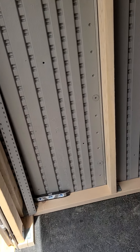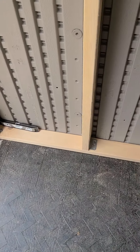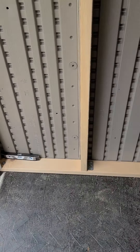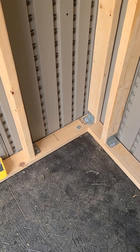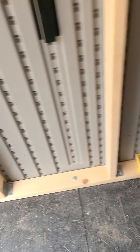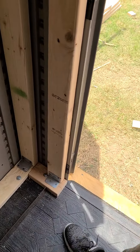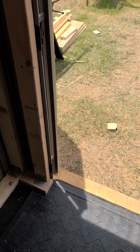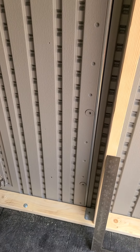What I did was take the lag bolts I initially used to install the actual flooring, removed them so there was no gap between my two-by-fours and the flooring, and put them down really securely in three different places on the floor studs. I put three in the front, three in the back, and three on each side. I used three-eighths by two-inch lag bolts so they go through the two-by-four and the floor with really great grip.